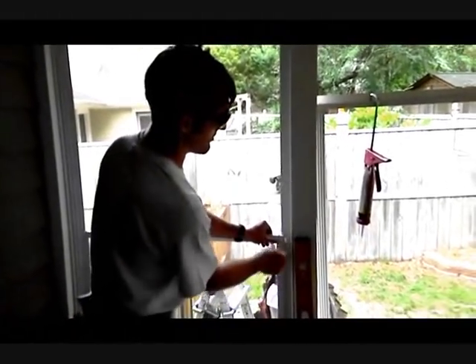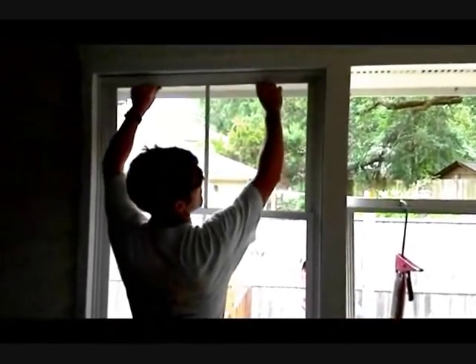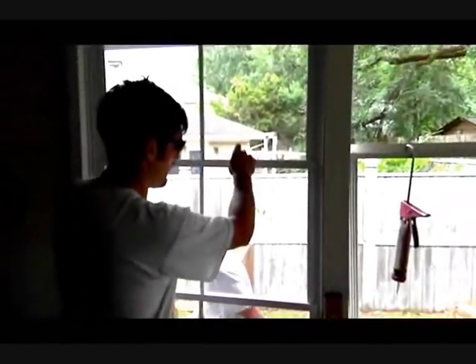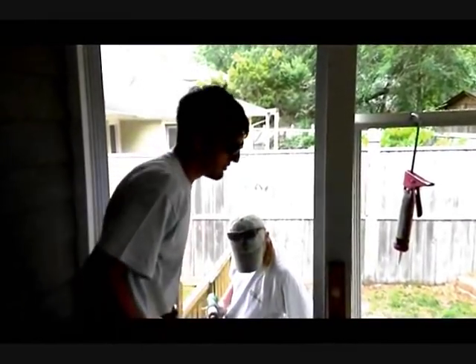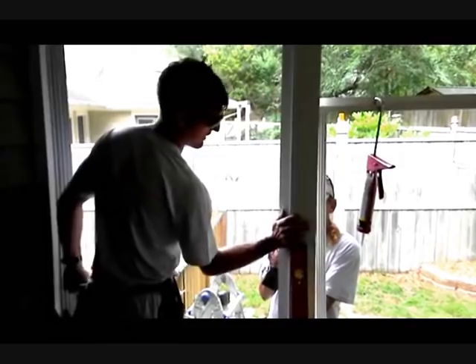Typically what we will do — you just pull that lever, open it up, and that piece from the packaging comes right out. Then we go ahead and push all the windows up, all the way shut. As you can see where these bars are, Brian has located that middle bar and is pre-drilling a third hole for each side. Once he's found those, you can shut these. One thing we typically do — because lots of times the screen is splined so tight that it can actually pinch the frame a little bit — is put some light tension on that to ensure that when you go to operate the unit, the screen is not pinching the frame and causing it not to operate properly.